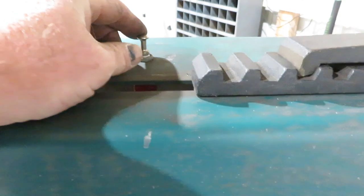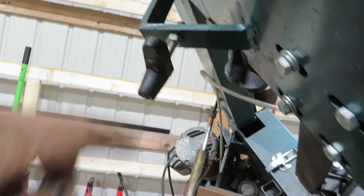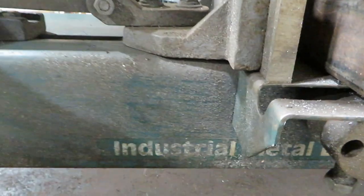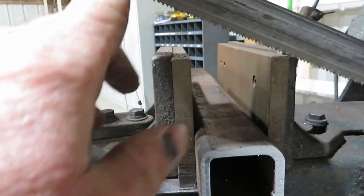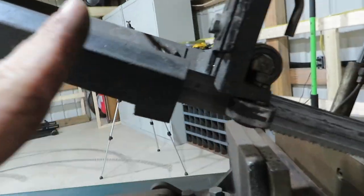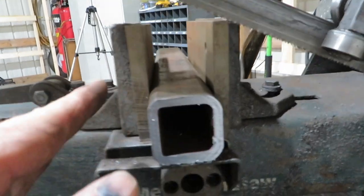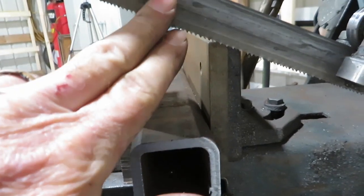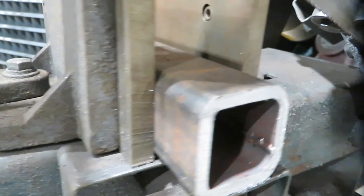The way this works — you've got your on/off switch right there, and it does have a stop right here so the arm comes down, hits the frame, and this little tab presses down and stops it. You've got a catch with three or four different positions for your stop. One thing I did on the first cut: I had this guide cleared — I forgot to actually put it in. So we moved the guide in closer to the material you're cutting and it keeps the blade in the position it's supposed to be. This blade does have a kink in it, so I'm probably going to order a new blade and keep a belt on hand as well.